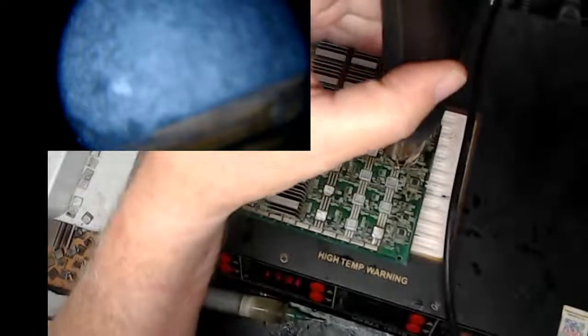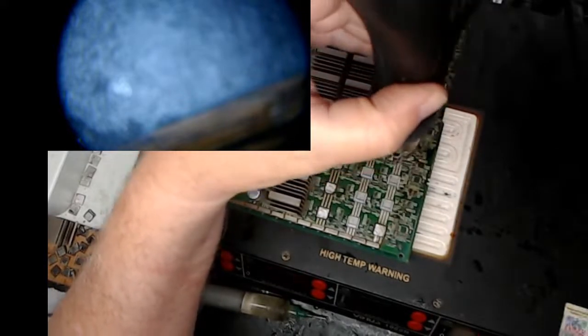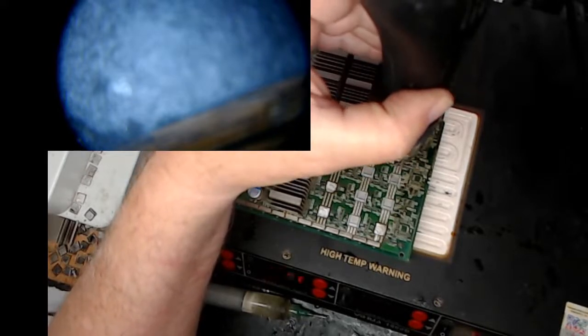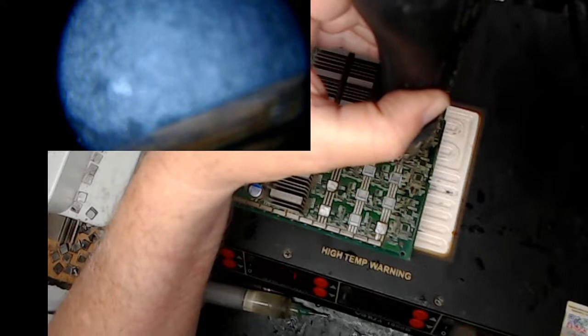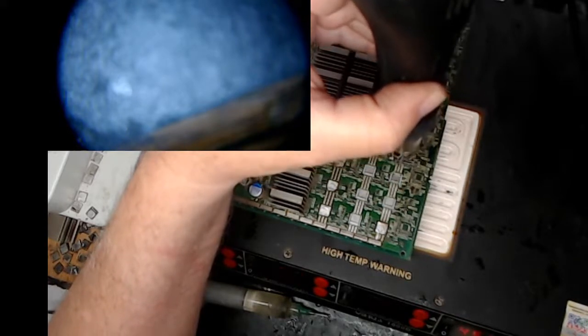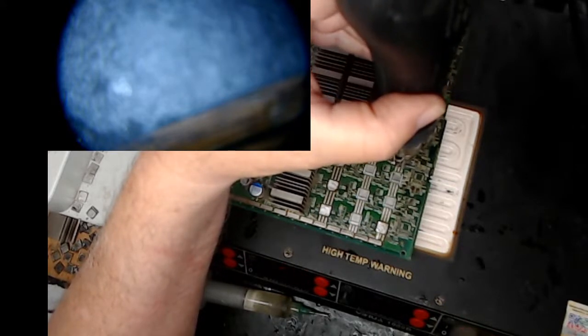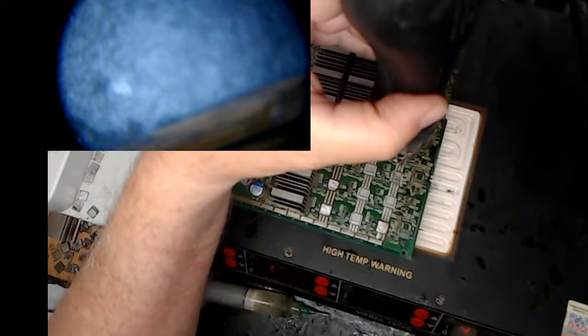What I'm going to do is heat this chip up, and I watch the solder on either side of the pins, of the pads. And the heat sink below has already been heated. I think an S17 Pro is like a T17. It's better to keep the heat sink on. I'm just going to run this up until I see that solder melt. If the chip moves, I'm kind of out of luck, because I don't try to change it around. Just haven't had great luck at it.